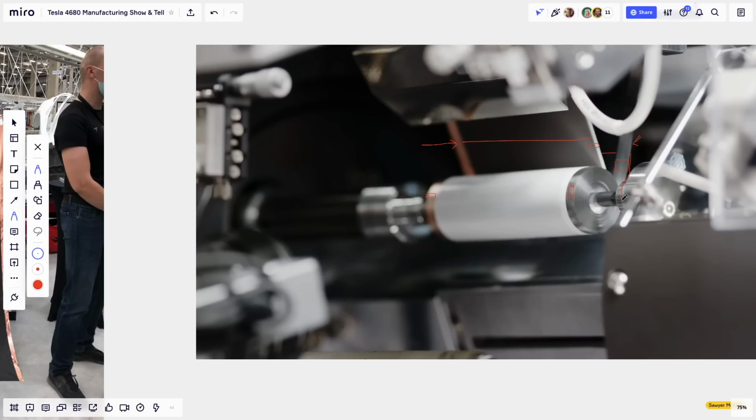you come to the white part here. So behind there, if you follow your eye, you would be going to another white material. So you have the copper anode and the aluminum cathode being wound with two separators. And once it's rolled, you don't see any black material anymore. Everything is covered up. The only thing sticking out on both ends is a little bit of strip of aluminum here and a little bit of copper on this end. You can see it's sticking out.